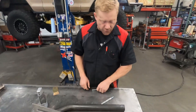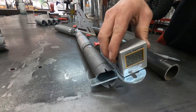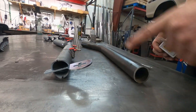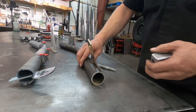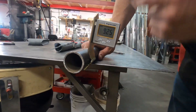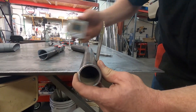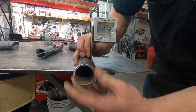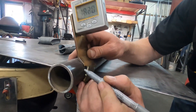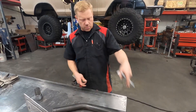Since we're over here we'll figure out rotation, and there are a couple ways of doing it. We've got this little rotation checker and you can stick that in there to find that 18 degrees. For our cope I'll want to come over on the far side and measure, because this is where our cope is actually going to be starting. So 18 degrees this way — we need to go 18 degrees like that. There, 18 degrees. Now I can mark that — there's the zero degree on my cope. The cope is all marked out.